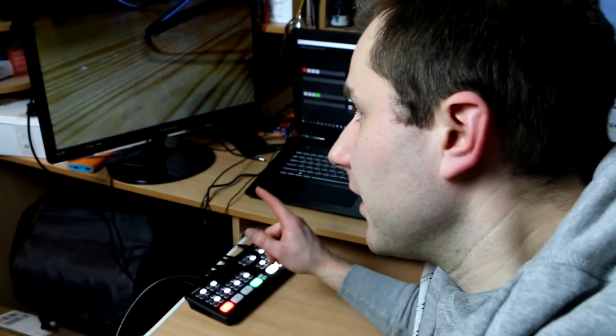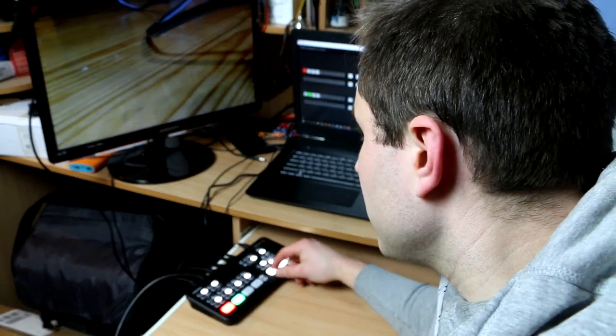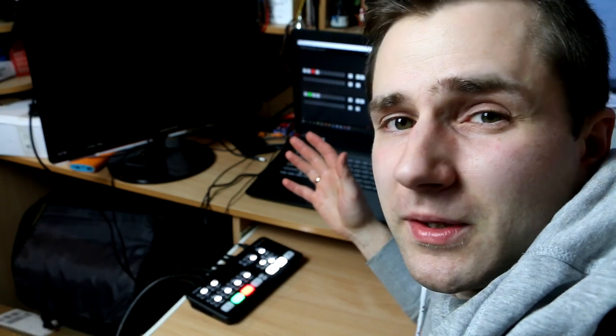So in the next part, I connected this ATEM Mini switcher to this screen output, and as you can clearly see, the number one camera gives out some sort of output. But if, for example, I switch to camera 2 or camera 3, there is no output at all. So I was rather sad, because I thought probably there is some fault in this one. But I had worries about whether there really was a fault, because before this, I tried using one channel for a camcorder and the second for a Canon 70D camera, and they worked together rather fine and had no problems at all.